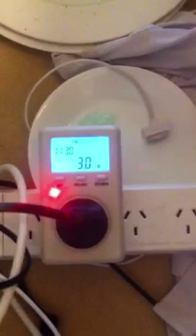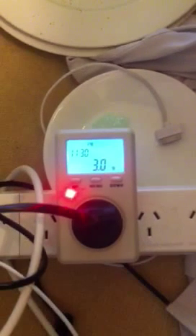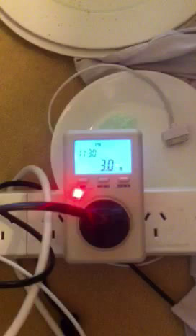If we go to the 60 SMD LED, we should be drawing about one quarter more — going from 48 to 60. Quite bright, attached to the LED driver, and we are drawing 3.0 watts, so about a quarter more, which is exactly what we'd expect.